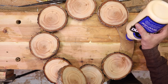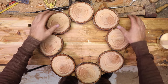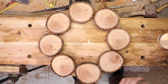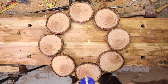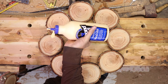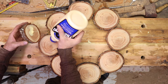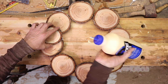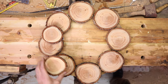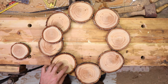I don't want glue on the face there — I'll come back and clean that off. Don't use this much glue. Just double-check everything and make sure we're equally spaced around there. Now the smaller-size pieces will look nicer — they'll bridge the gap and cover up those seams, covering up the plywood. Because these are hand-cut they're going to be a little uneven, so make sure you find the high spots and fix that where it's going to sit. See that teeter-tottering there a little bit? Turn it until it matches up a little bit better.